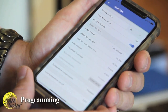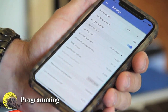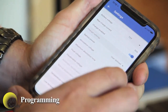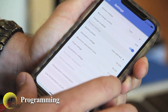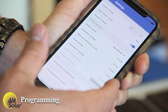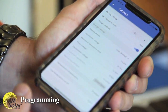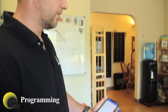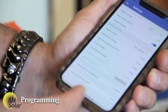Because the solar charge controller is responsible for charging the battery, you need to make sure you can program it specifically for the type of battery you have. I really like the Victron system because you can log into it with a Bluetooth connection and have fine control over all the parameters. For a lithium battery, that means an absorption voltage of 14.2, an absorption time of 2 hours, a float voltage of 13.5, and no equalization. You'll want to confirm your charge controller settings match your battery type — flooded, AGM, or lithium. Some cheaper charge controllers only give you one preset or a dial with three options, while Victron lets you get exactly what you want, which makes your batteries last longer.